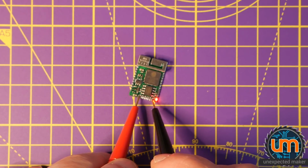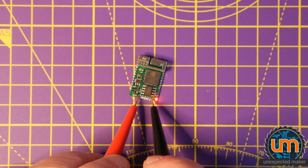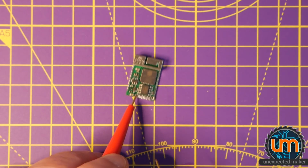Well, we've got a power light. Let's hold it for a bit and see if any smoke happens. Now it's gone to 18, so obviously the Pico's booted because it should be sitting around 18 to 20 milliamps. But that's pretty cool. We have a working board, no shorts, no smoke, and a powering Pico. I can tell from the power being pulled. So it's time to build a programmer.